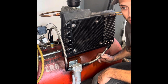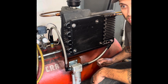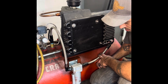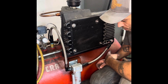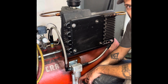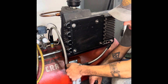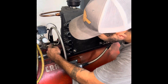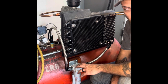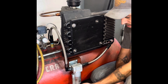Coming out the bottom — because this is significantly colder — I was able to run some braided stainless, a general-purpose line I got from Raceflex. I'll put a link to their website in the description; they're not sponsoring me or anything. I ran that into just a normal filter/dryer water separator, and then from there I came out of the top with more braided line and went into the check valve and down into the compressor tank.